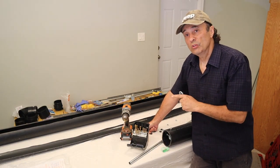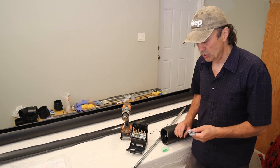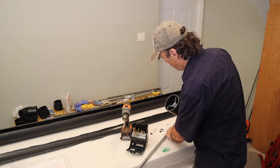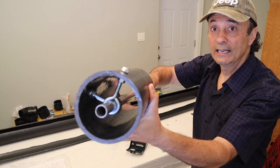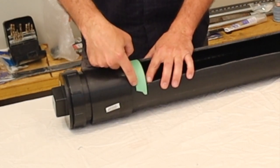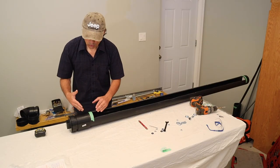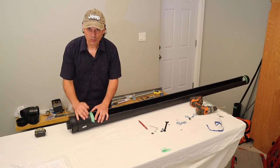The next stage is to put the fasteners in on the ends of the four-inch ABS pipe that will support the middle bar. I'm going to take these eye bolts and secure them inside the four-inch ABS pipe so they overlap, and that way the two ends will cradle the pipe. Here's a mock-up so you can see the eye bolts secured inside and a half-inch pipe just works like that. I put a piece of tape and marked from each corner to locate the holes for the two bolts. I'm going to have them putting a little bit of pressure against each other to help hold in place, but if you want to offset them you can.